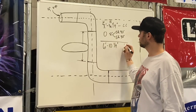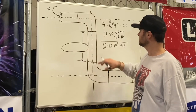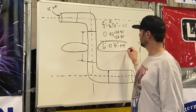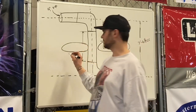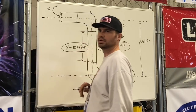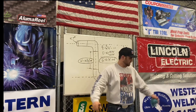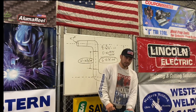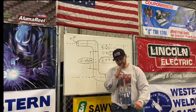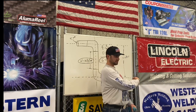Six foot ten and a quarter inches — that's our pup length for this problem if these are short radius 90s. We circle it and write it in. We label this pup because this is the one we're going to cut. So with jack stands laid out and four-inch pipe, we hook the tape measure on one end, pull down to six foot ten and a quarter, make a mark, set the bevel machine, cut it, clean the ends up, and weld the 90s on — one facing one way, the other facing the other way.